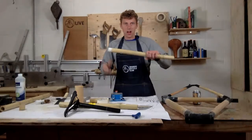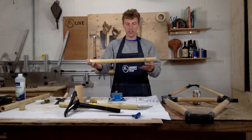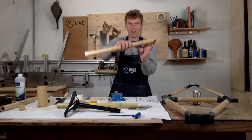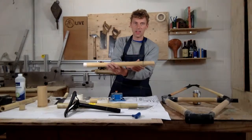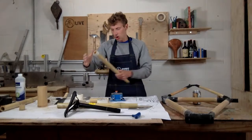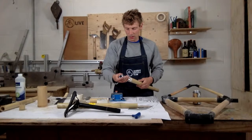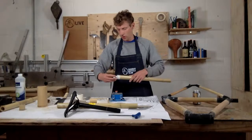Check your measurements — whether the seat tube is going to be 560mm or 460mm, just make sure it fits within the frame parameters. On the frame I'm working on here I've got plenty of excess, so I can cut at this end. If I didn't have as much space, I'd cut at the other end where the section is smaller, leaving more tube. Look at your drawing and see where the nodes line up. It's all cut squarely now, and the seat sleeve fits in really nicely with just a little bit of movement for the glue to soak in.